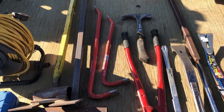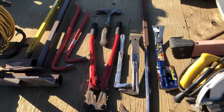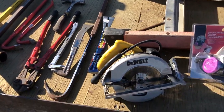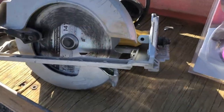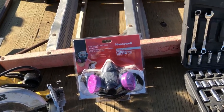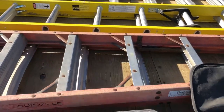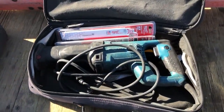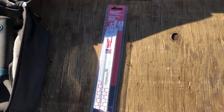You're also going to want a number of pry bars, bolt cutters, hammers, and maybe some tools that you build yourself to get some of these boards off. The skill saw is awfully handy with nail-biter blades. And every time you're doing anything, you're going to want a dust mask — I mean, that's 100 years worth of dirt. A couple hand wrenches and ladders of multiple sizes, and lots of those.